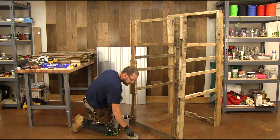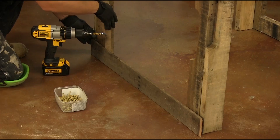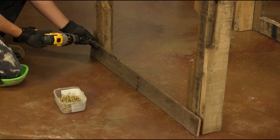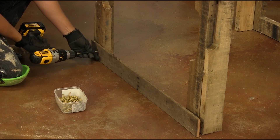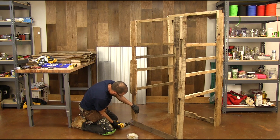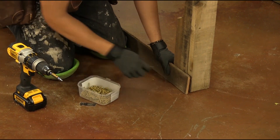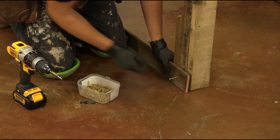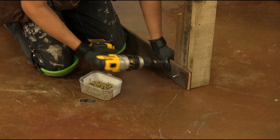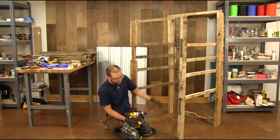This is where we're going to start using the little screws. We've just drilled a hole in each end about two to two and a half inches in so that we have a space to hit directly in right there. The first board will square us up and then we're just going to repeat this all the way up, trying to stay as square as we can going up.